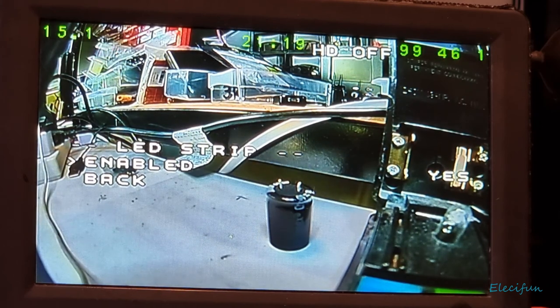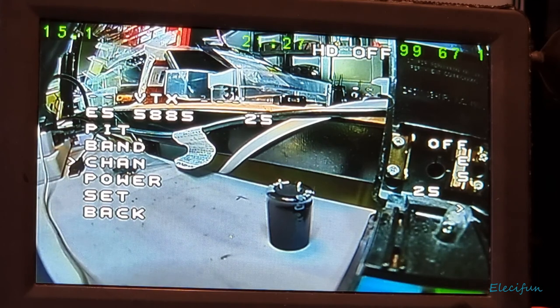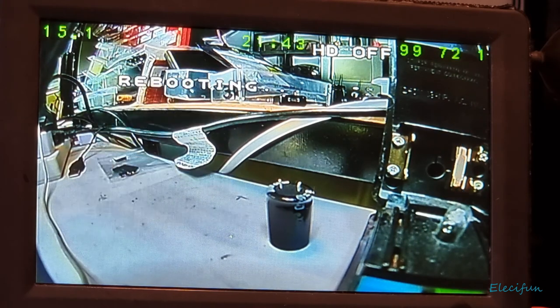I'm trying to see where we got our. There we go. And then go back. We'll have to reboot it for that to happen, but look at the VTX as well. So we can change our power, our channel, and our band from there, and even put it in or out of pit mode. So let's just say we've turned that off. You see, we've turned the LEDs off now, which we can turn back on again when it reboots.